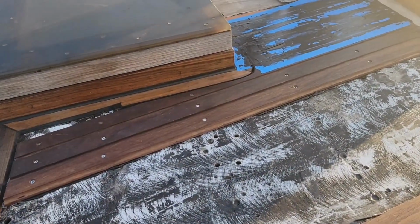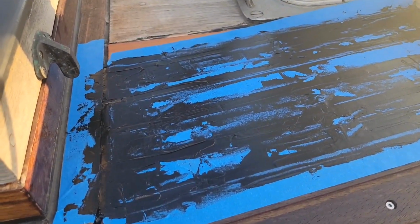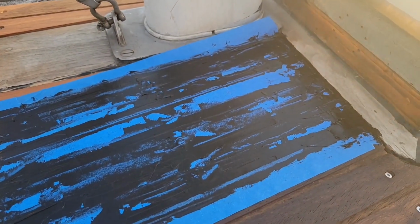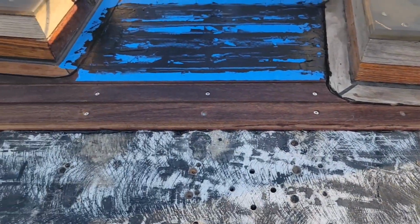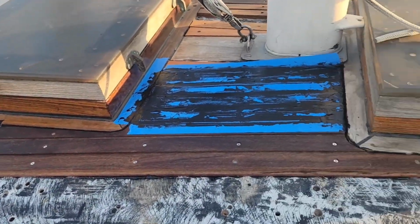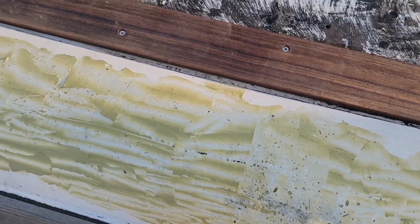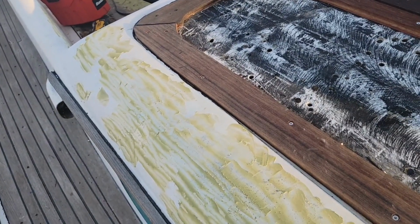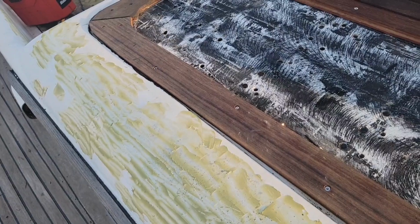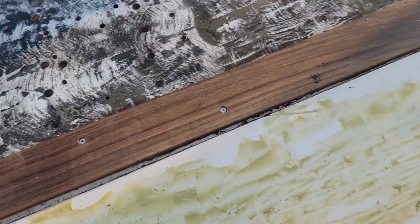All right. Well, we got more in here. And then we got the sealant in. And I'll pull this off tomorrow. Should be pretty good. This surface has been scraped really good. And tomorrow, when we did all this here, I'm gonna put epoxy over the top of this. After I sand this, then I'll do epoxy, and then I'll rough the epoxy, and then I'll put primer, and then I'll put a paint that's designed for boats and make it real shiny.